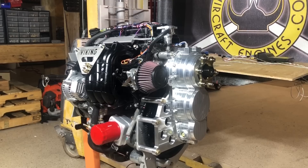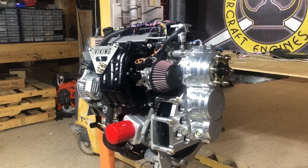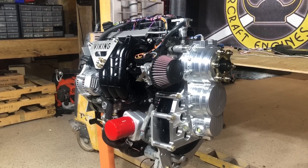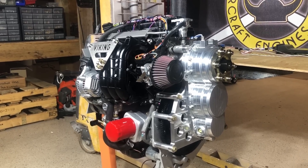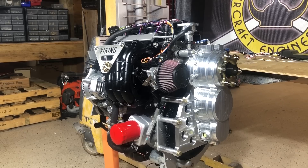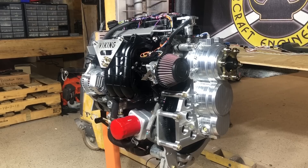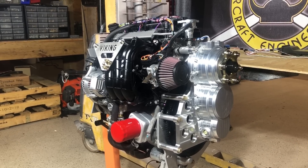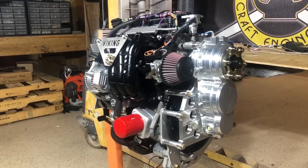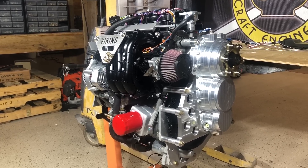Looking at the engine from the front, we're basically looking at a three-cylinder liquid-cooled engine. You see the reduction drive on the right with a propeller flange. The propeller flange is the same as a Rotax-powered engine — 101 millimeter with 13 millimeter lugs and 8 millimeter bolts — so all propellers that fit a Rotax will also fit the Viking 90, as long as it's a three-gear gearbox. That makes it a right-turning rotation engine.